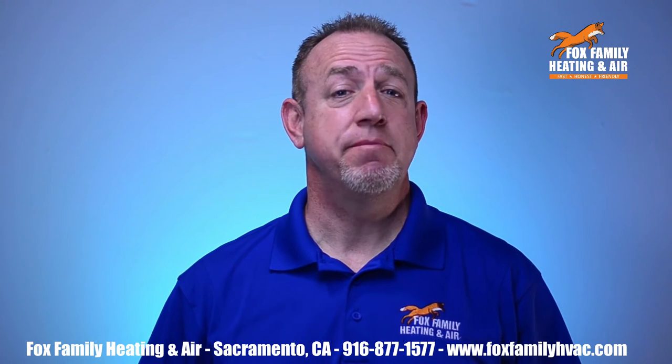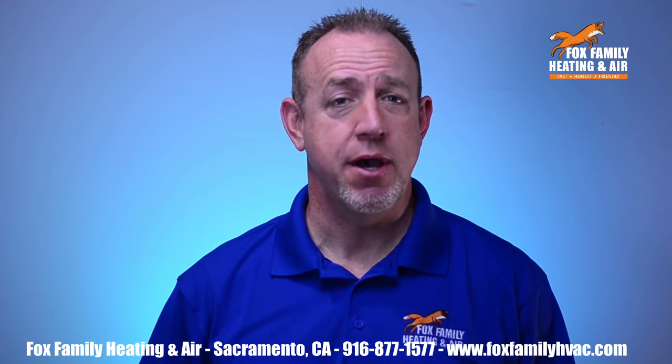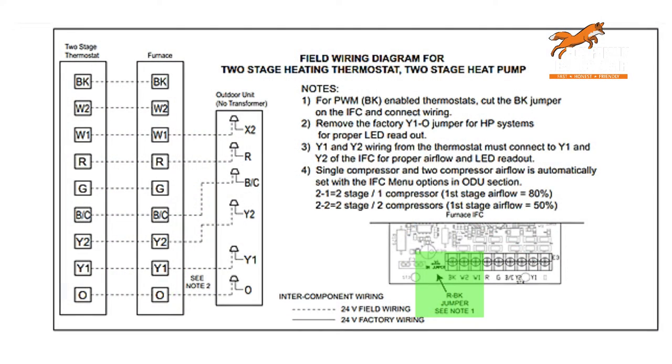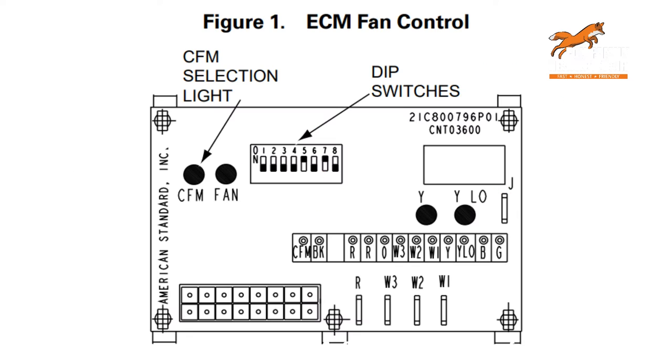Number one, it's something that your installers have to set up for you at the time of installation. There's a BK jumper on the integrated control board for the Comfort R enhancement to work. Air handlers also may have dip switches to dial in for the indoor variable speed motor to match the airflow required for the outdoor unit size.